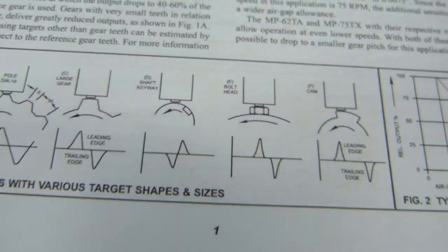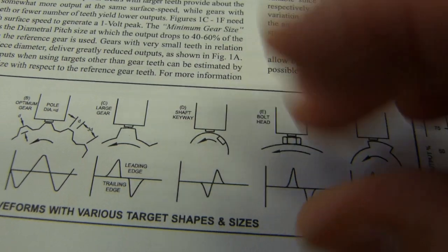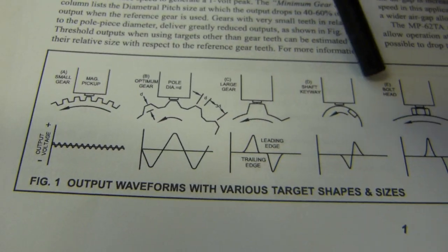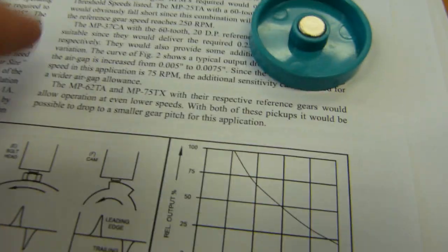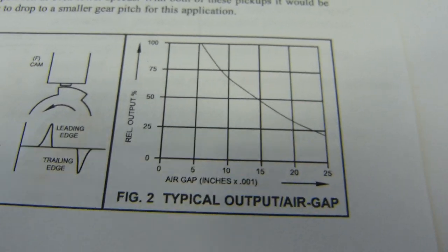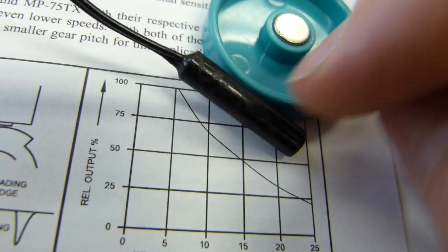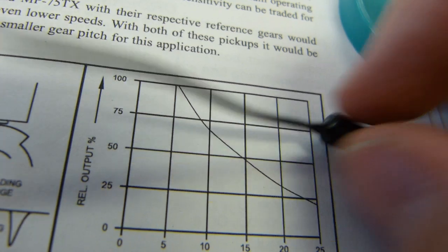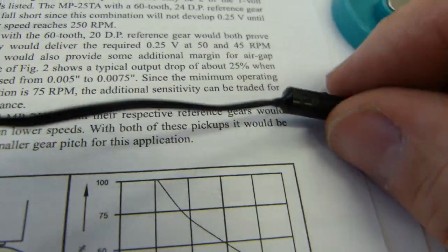So any kind of rotating objects, that's a cam. What you see here in the graph is that this rotating magnet over this coil produces a pulsating signal, one single pulse as it passes through. That one pulse of electricity is what you see here as signal output from this wheel speed sensor or belt speed sensor or just a speed sensor, whatever. Over here you can see the air gap specs. So 5/1000th of an inch is standard. It can be twice, 3, 4 times that. It can be more than that. But as the magnetic field is further away from the coils, fewer electrons will be moved in the coil. So that's what this graph is representing, that the amount of electricity it generates is decreasing with this distance increasing. So try to get this sensor as close as possible.